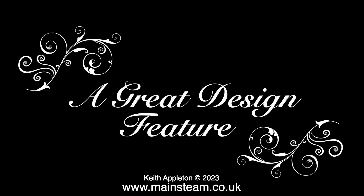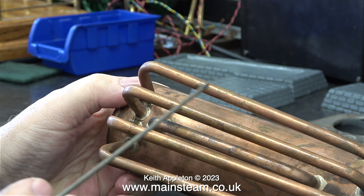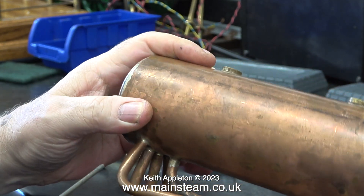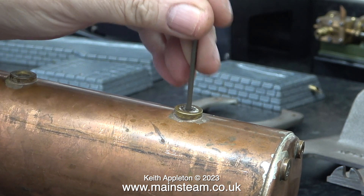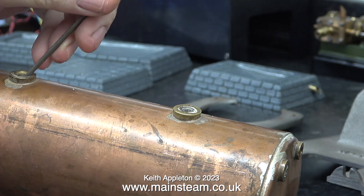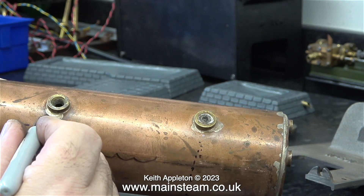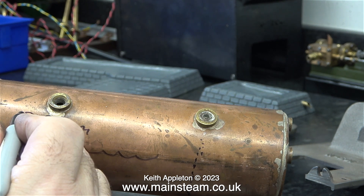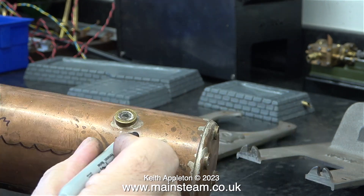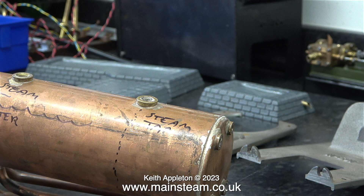This boiler has a great design feature. Here I'm pointing out the four water tubes that hang beneath the boiler. The middle tube looks different because it is not a water tube - this is a superheater tube, also known as a steam dryer. Inside the boiler, one end of this tube goes to the bush that connects to the steam tap, and the other end of the smaller center tube goes almost to the top of the boiler inside. Using modern technology I'll create a simple diagram so you understand how it works. The wavy line is the approximate water level, and as you can see the steam takeoff point is above the water level. When the steam valve is opened, the steam from the boiler goes down this pipe, back through the fire, and then comes up inside the boiler to the tap itself.